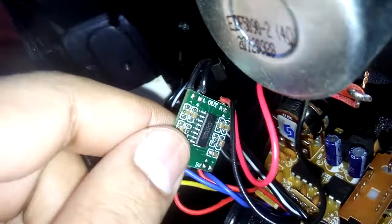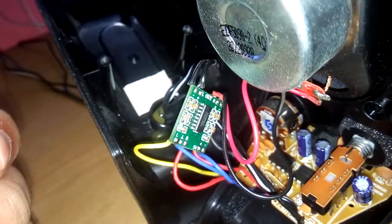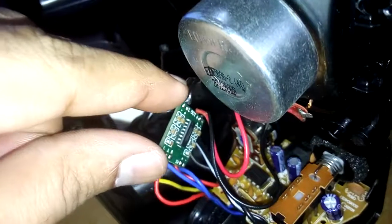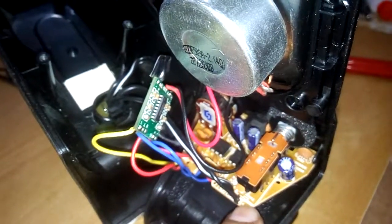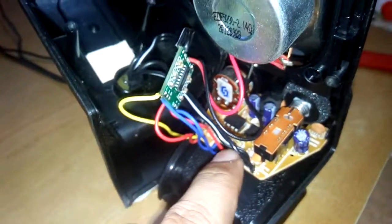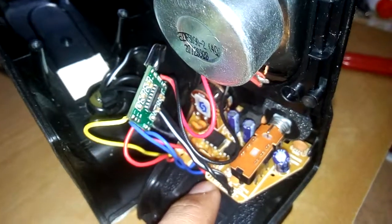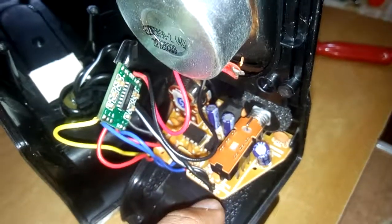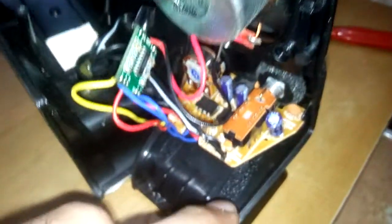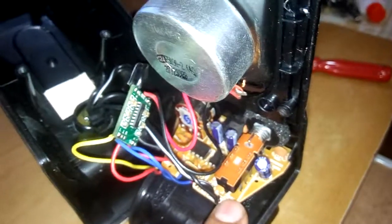Here it is — the 8403. This is a digital amplifier kit and it's very tiny, as you can see. So actually one side of this built-in kit — I mean one speaker — was down; the IC was faulty. I tried to fix it but it was kind of hard because the board was not so good, and the soldering and re-soldering of new parts was difficult. The main thing was that I was not so satisfied with the sound this kit was producing.